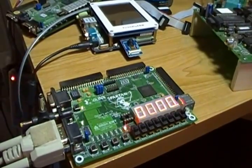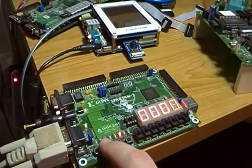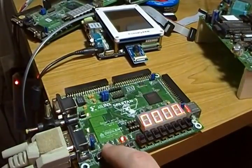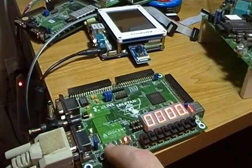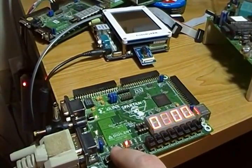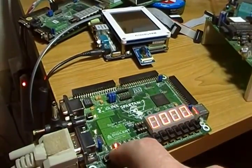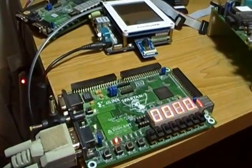Not very exciting because we've just reset things. This button changes the mode I'm in — you'll see the LEDs moving every time I push it. That was register select mode. This is load program counter mode. This is the examine mode — how we look through memory; it loads the accumulator from whatever the program counter is pointing to. The deposit mode lets us put things in from the switch register into the current program counter location. We can single-step or start the program running. The next LED comes on when the program is running, and the last one is a program-controlled LED you can use as an output bit.